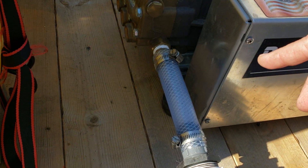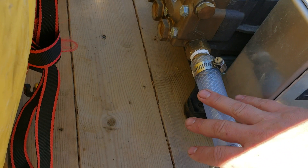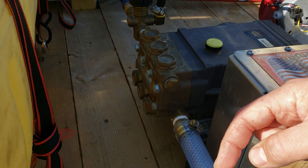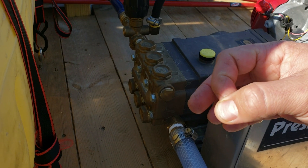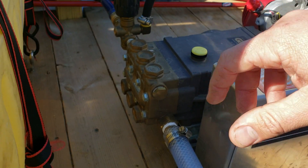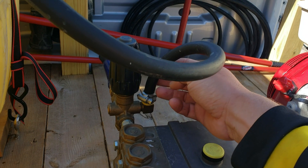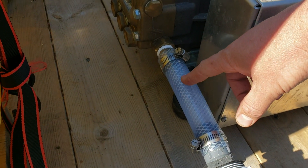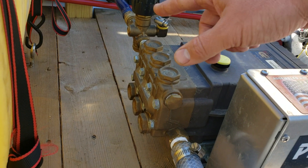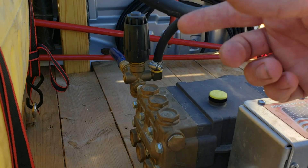The other nice thing on this, talking about winterizing it — all he has to do is shut this ball valve, open the dump valve so it drains all the way out, and that'll get the water out of here. Then we're going to put an elbow on this other side with a garden hose fitting, going from three-quarter, just a 90 brass fitting, then from three-quarter male thread to three-quarter male garden, and then you just put a female garden cap on top. Angle it out here, dump the antifreeze in through there. This will get quick-coupled so he can just take that off. When you run the antifreeze through it, you want to see a little bit of pink on this side, and then he knows he's good to go. He can blow that out with an air hose or pull the pressure hose out with an air compressor.